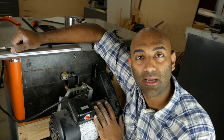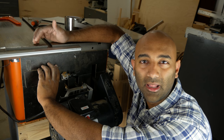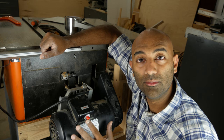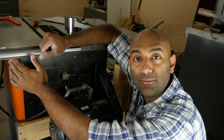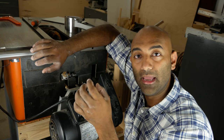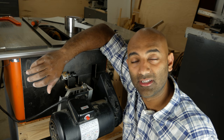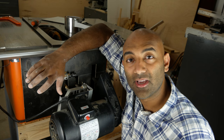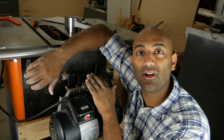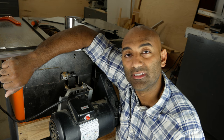Alright, so there's our rundown of our top table saw dust collection upgrade ideas. You can create wooden templates — start with cardboard, create the template, then use wood. I painted it black, but you don't have to. Use these to close off large openings in your table saw, and again you're not going for perfect. Make sure it can accommodate table movement when the saw goes up and down. Use aluminum tape or duct tape to close off where the saw body meets the table. And if you have a hole in the bottom of your cavity, make sure you fill that up and allow yourself a little insert for the dust collection port. If you're going with a shop vac, we highly recommend getting the Dust Deputy — get the kit or the Dust Deputy by itself. A little bit of work to build your platform and attach those two pieces together, and they're going to become best friends and a huge ally in your workshop. I roll it around to whatever stand I'm working on, whether it's the table saw, the router table, or the jointer.